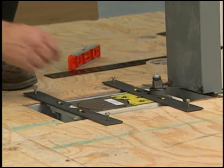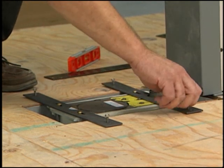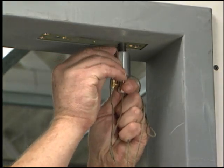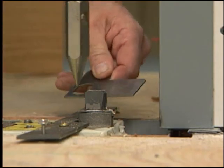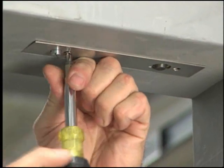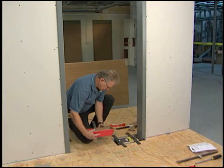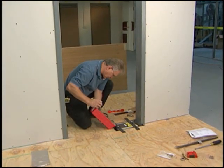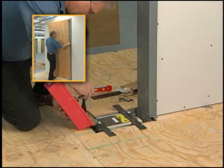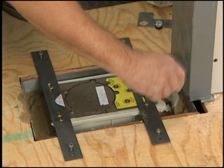Place the bubble level on top of the spindle and make sure the body is leveled by using the leveling screws. Double check with the torpedo level. Remove the pivot alignment tool, then remove the pivot locator, and retract the pivot pin. Put the finish plate on the frame portion of the top pivot. Now you are ready to surround the case with cement. Some installers may choose to partially fill the hole with quick-dry cement and test fit the door prior to completing the installation with standard cement. Be sure to use standard rather than quick-dry products.